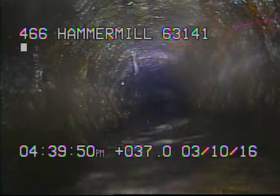Right here, we'll come back to the cast iron. The problem with also trying to clean out the line from the cast iron is we cannot run a big enough cutter to do an adequate job to remove all the roots.